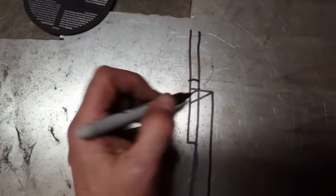And as I was going around, I kept an eye. I may have to weld up a few spots here and there, but for the most part, now it's done. I got my big grinder here now, 36 grit disc on it. Some people like using a grinding stone or a flat wheel. It's your preference, whichever way you like. Me, I'm old school, I like these old discs. Usually I use a 24, but all I got here in stock now is 36. So I'm going to start grinding this up here now and cleaning it all up and see what she looks like.